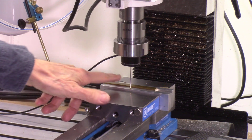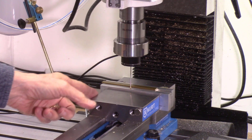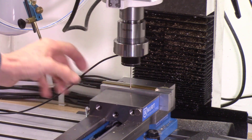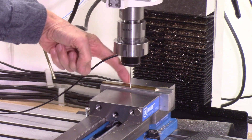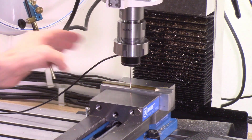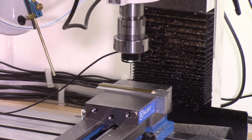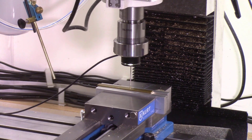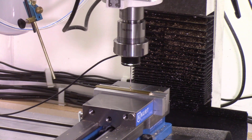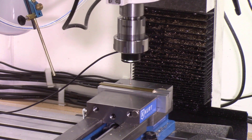The first step is to locate the center of my brass bar, since all dimensions of the schematic are located from the center position on the brass piece. I'm using a probe which will automatically determine the center of the brass bar in the Y direction. It senses the front edge, then goes around and senses the back edge, divides by two, and locates the center position. The probe moves to the center position on the bar and I save that position in the software.